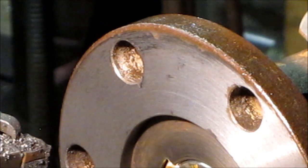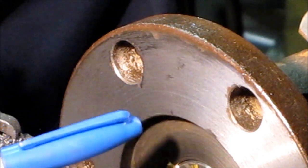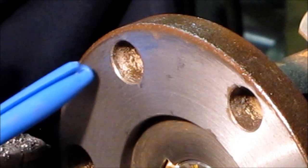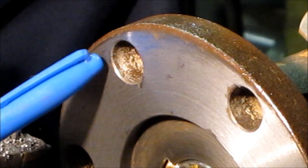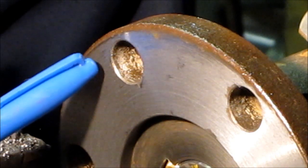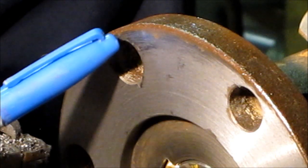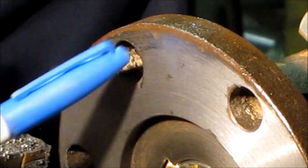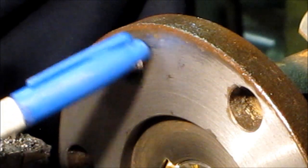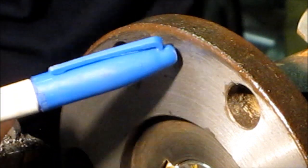Okay, I got you set up again. I got you in this shot here because I know that you can see it well. Here is that hollowed area. You can see some when you're close to a surface cut on cast iron, rusty or whatever, and you're real close to the surface. When it skips, it makes a gloss impression or smoothness texture. But you can see right there is a little hollow right there on the edge. It's not really cleaning out sharp there.